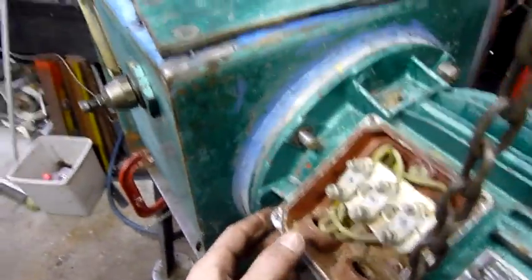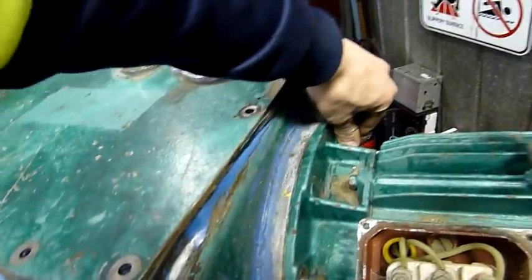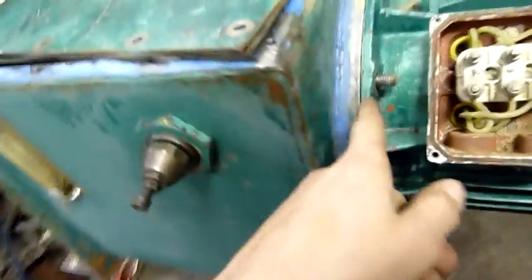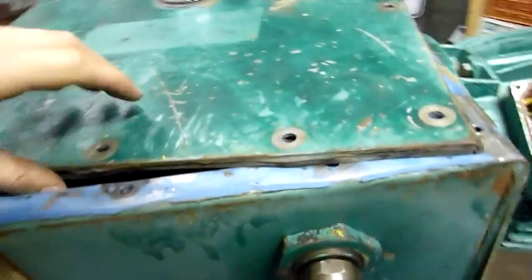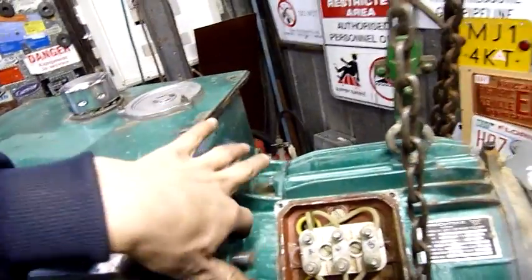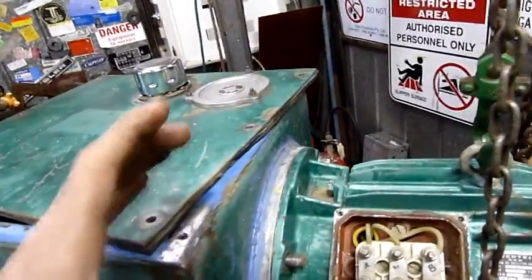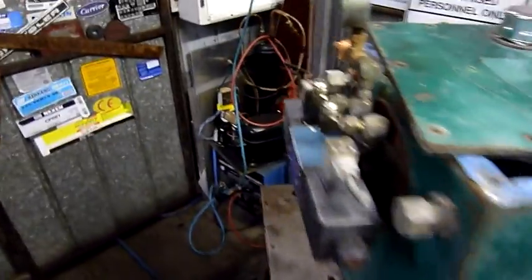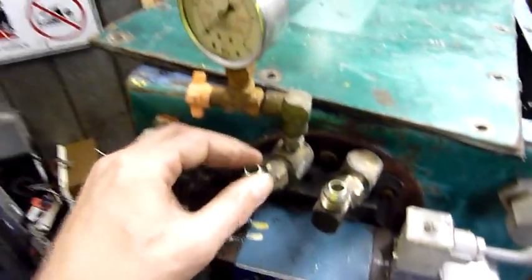Either way, it's fairly heavy — I don't know why it's so heavy. But the motor's broken loose fairly easily just undoing these nuts. It's just cracked away and it's not dumping fluid on the floor, so the bell housing here is clearly held in place by other bolts or cap nuts. That's sealed. So we've got a bell housing with a drive coupling and a rubber drive member — or whatever you want to call it — a flex coupling.